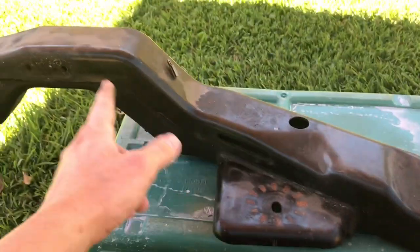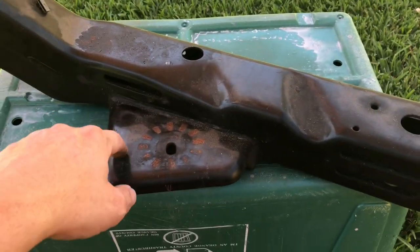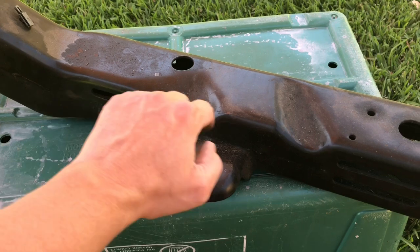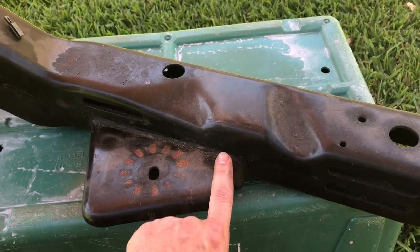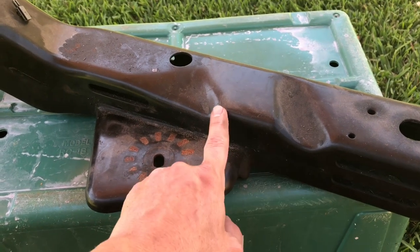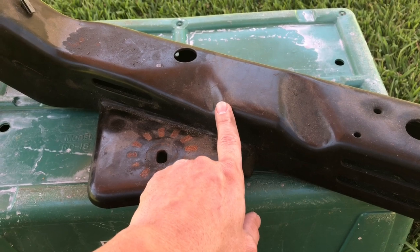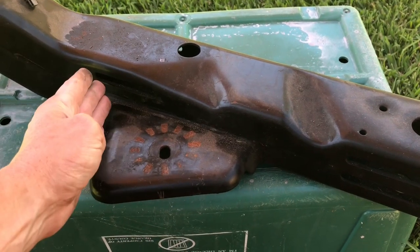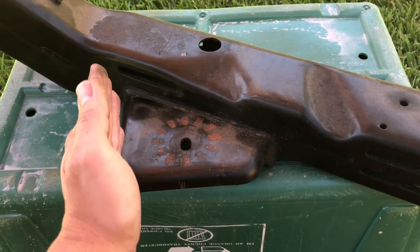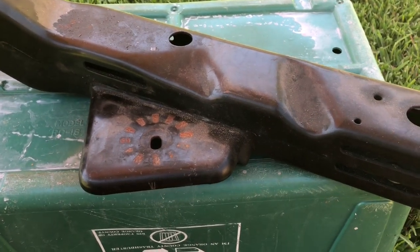I think what I'm going to do, instead of cutting each side and moving it and shifting it and all this stuff, I'm just going to cut this plate off - it's welded right around here. And actually, if I move this right up to this edge, that's about an inch and a half up, which is what I need. So I'll just cut it off and weld it here. But I'm also going to take some flat bar and put it on the other side of this here. That way, it'll allow me to slide it forward an inch and a quarter, and I'll just weld in a filler plate back there as well. I think that's a better plan.